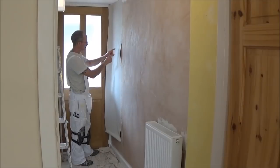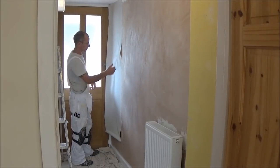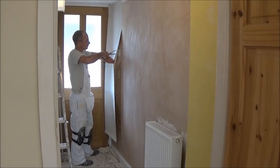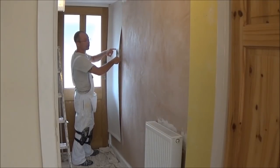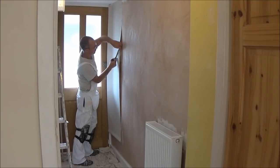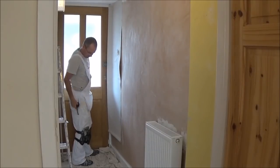Where your light block is, find the corners and push with your thumbs on the corners to put some marks on the paper. Let the paper come back a bit because you don't want to scratch the socket on the wall. Taking your scissors, pop a hole in the paper and cut just over the corners in a very neat cut.